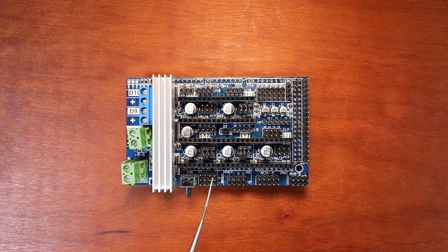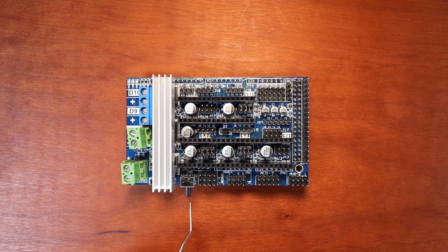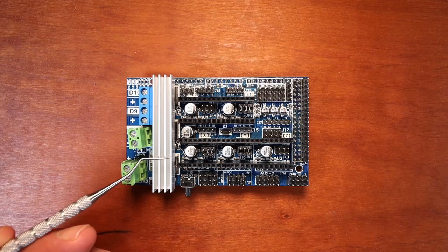have our pins over here where we have 3 sets of 4 that are used for 4 different types of servos, but we can use this for other things such as driving fans, which I'll probably get into in later tutorials. Over here we have a reset button, and then below this little heatsink are 4 things that are actually being wicked away for heat, and those are our MOSFETs.